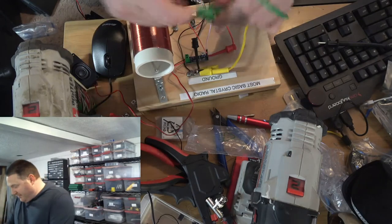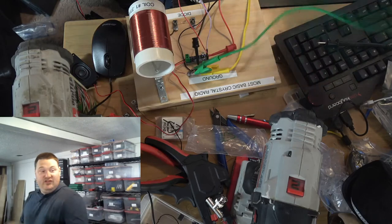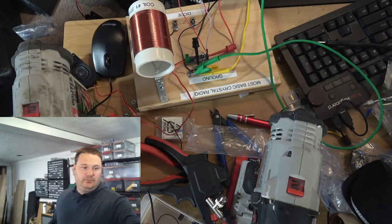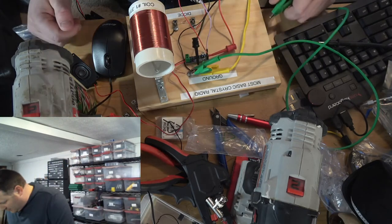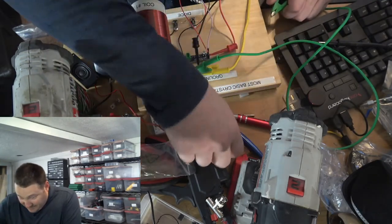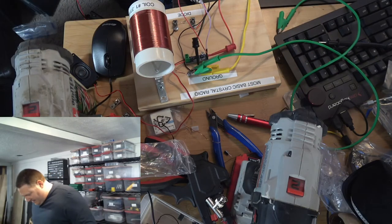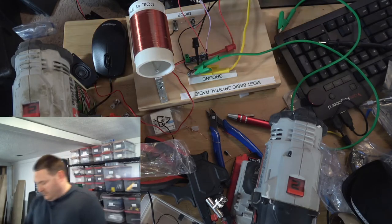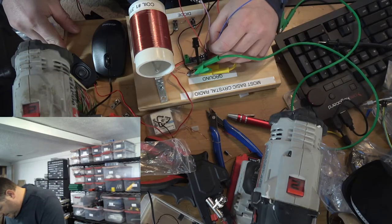So the radio itself is powered simply over the air. It's just the RF. There is no DC involved here. Let's see, that's ground. The amplifier is using the 5 volt supply. So when I'm listening with just my headphones, no external voltage is required, which is pretty cool. I mean, that's one of the unique things about crystal radio.